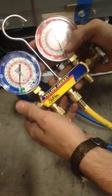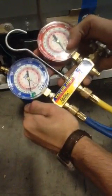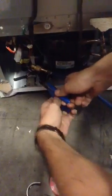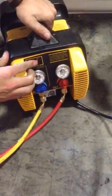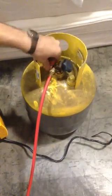You can see now that it is at zero or below. You can now turn off this valve and remove your pliers — sometimes they get a little stuck. You're going to turn off your blue valve here, it has nothing more in. Then turn off the evacuation machine, and turn off your valve to the tank.